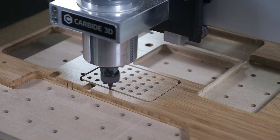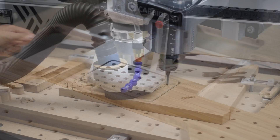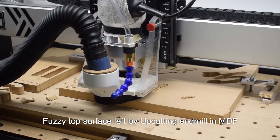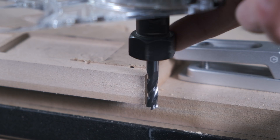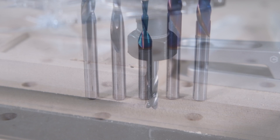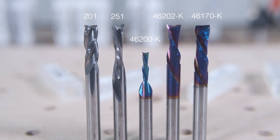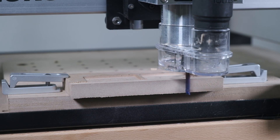In wood, plywood, or MDF, a down-cutting end mill may be advantageous because the cutting action of the rotating end mill will naturally mat down the fibers, preventing them from tearing out or chipping. Up-cutting end mills act just like drill bits — they're constantly trying to pull material upwards. Down-cutting end mills do the opposite. We offer the 251 quarter-inch down-cutting end mill, as well as two options from Amana. Compression end mills give you the best of both worlds — they pull material up at the tip and push down from above, so you can get really clean walls on both the top and bottom surfaces when contouring.